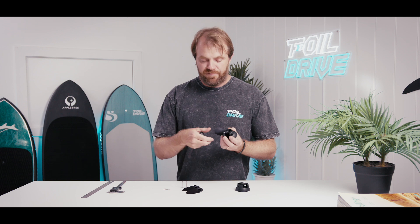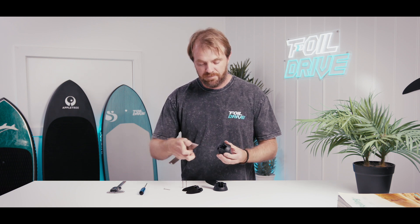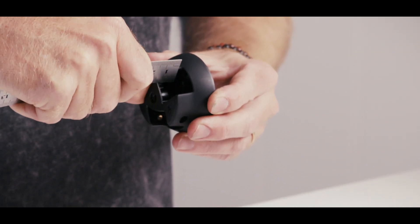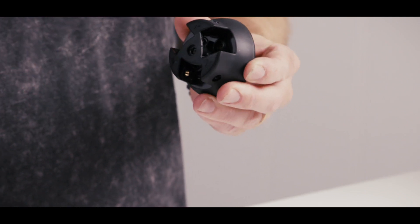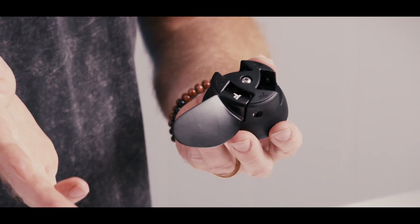A better solution if any of your blades are sticking when flipping up and down: get a ruler or something with a sharp edge — not a knife, that's dangerous — but a ruler or similar, and simply put it in here and with a bit of force just scrape it two or three times. That's about it. What that does is take off this tiny little lip of plastic, and if you then check that propeller again you'll probably find it flops in and out perfectly.